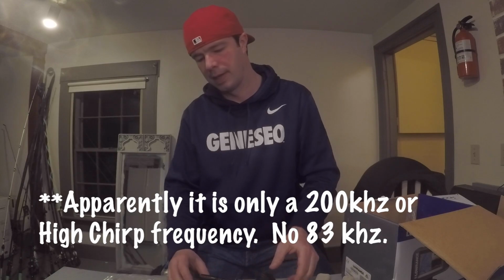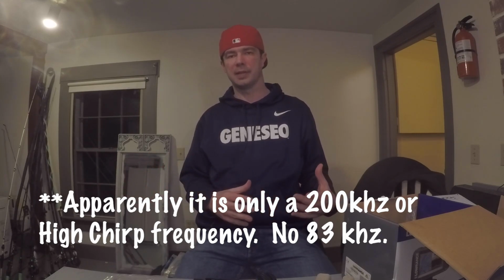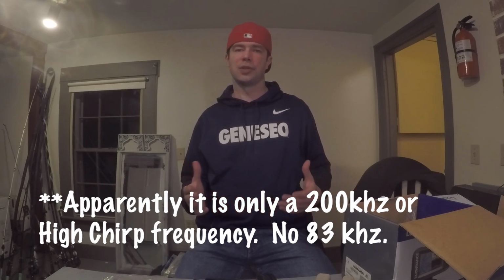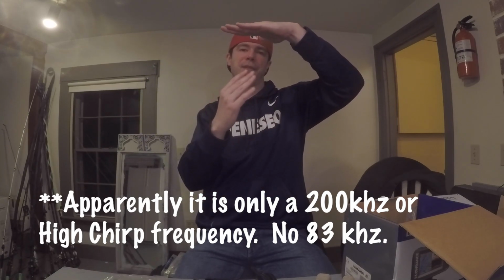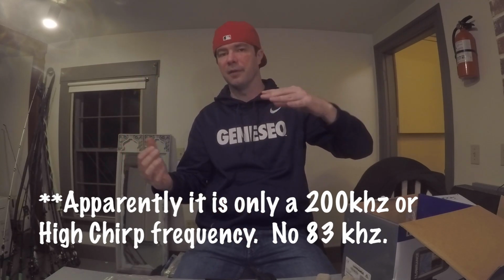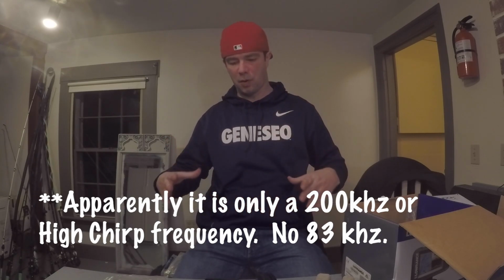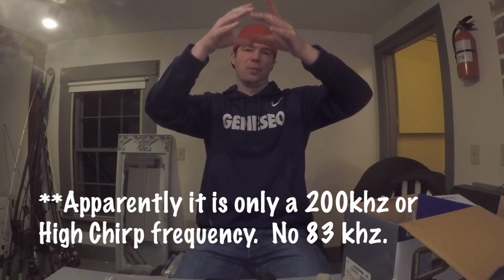One of the main features of the Hook 2, why they stopped producing Hooks and went to the Hook 2s, is that their cone angles are going to be twice as wide as traditional sonar. Your 83 kilohertz is usually somewhere around 1:1, so for every foot of depth you get a 1 foot cone diameter. The transducer emits sound, receives it, and turns it into information, in the shape of a three-dimensional cone. So at 10 feet, your cone diameter at the bottom of the lake is going to be 10 feet wide, and it'll read all the information within that cone.